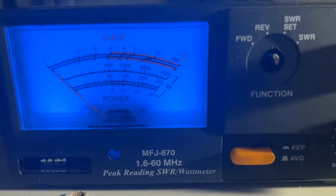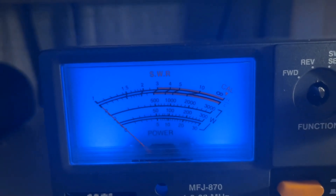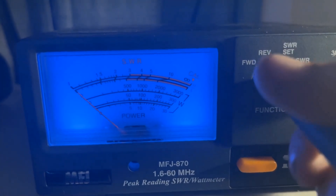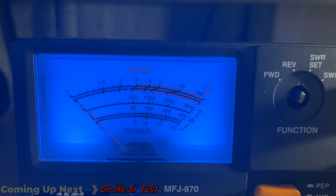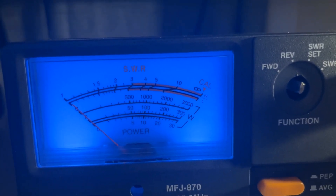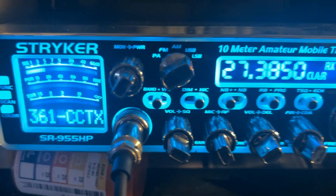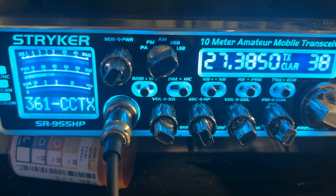We are on calibrate right now, and we're right on that calibrate mark. Now let's go over to SWR. There's the SWR — barely moving. I'd say that's a 1.02 to 1 or 1.01 to 1. Perfect. I'm actually doing pretty good. I just hooked up the dipole back up and tested a new smaller 1 to 1 air choke.